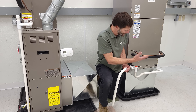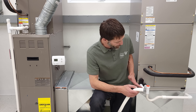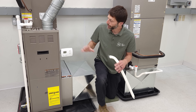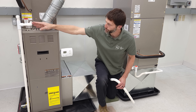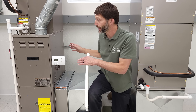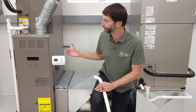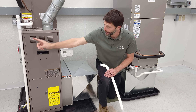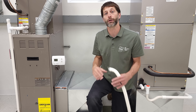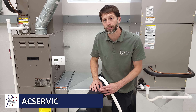To recap: on an air handler, you have negative pressure — a reduction below atmospheric — so you must have a trap, otherwise water builds up in the pan and overflows. For a gas furnace with an evaporator coil, you don't need a trap, but you will lose air through the condensate line to the outside unless you use a water trap, dry trap, or route the condensate line into the bottom of a condensate pump. For a wall-mounted ductless mini-split, no trap is required. Check out acservicetech.com for quizzes, articles, calculators, quick tips, and a refrigerant charging and service procedures book.